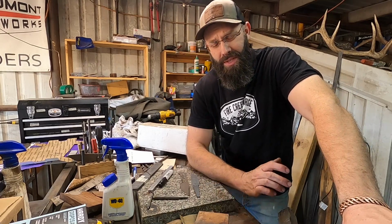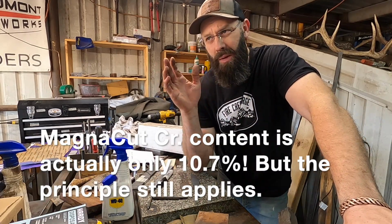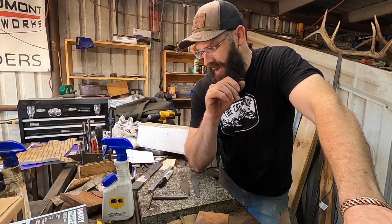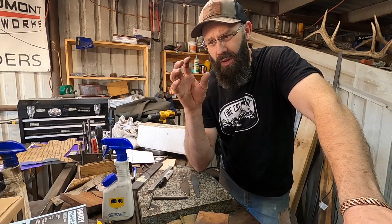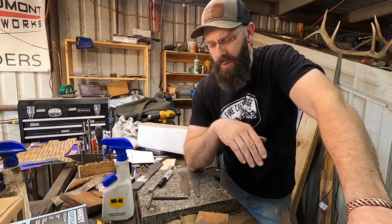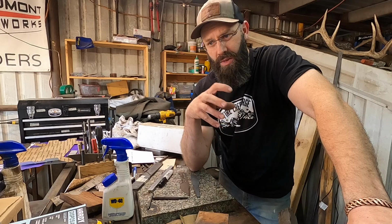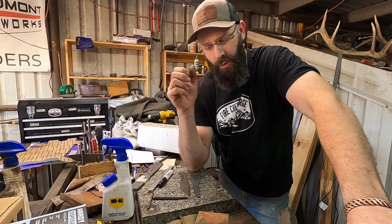The austenitizing temperature is necessary because of the very high alloy content. The chromium, any stainless steel is going to have a minimum of like 12-13% chromium and goes up to somewhere around 18%, I believe. But any alloy like that, including things like vanadium, molybdenum, tungsten, these all significantly slow down the movement of carbon within the structure of the steel, going into solution as the term goes. And so it's necessary to heat the steel up much higher than a carbon steel to overcome that, so that the carbon can go into solution and you can actually achieve appropriate hardness levels for the steel.